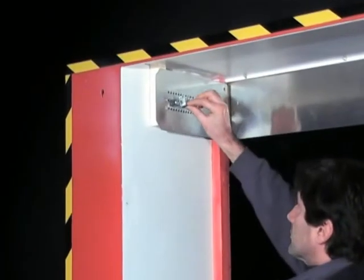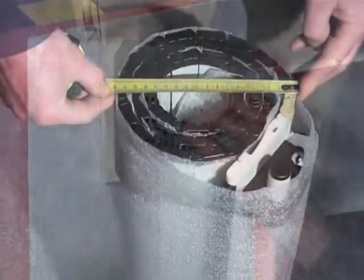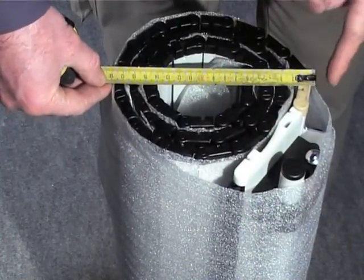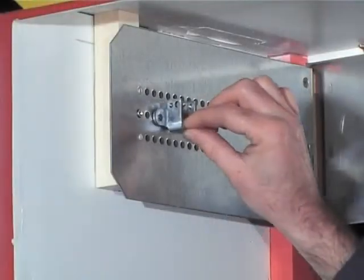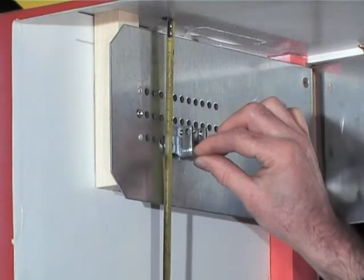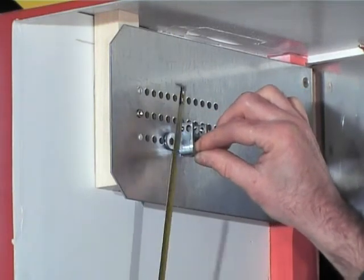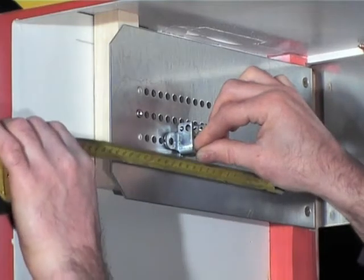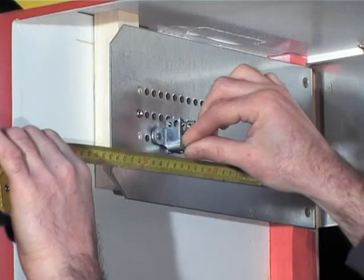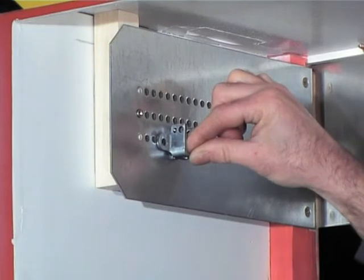Now you must determine the position of the roller support on the side panels. To obtain the vertical position, measure the radius of your rolled-up shutter and compare it with the available space between the centre of the side panels and the top of the compartment. To simplify the task, use this formula: if the radius of the rolled-up shutter plus 20mm is less than or equal to the distance between the centre of the side panel and the roof, then the best adapted position will be in the centre of the drillings.